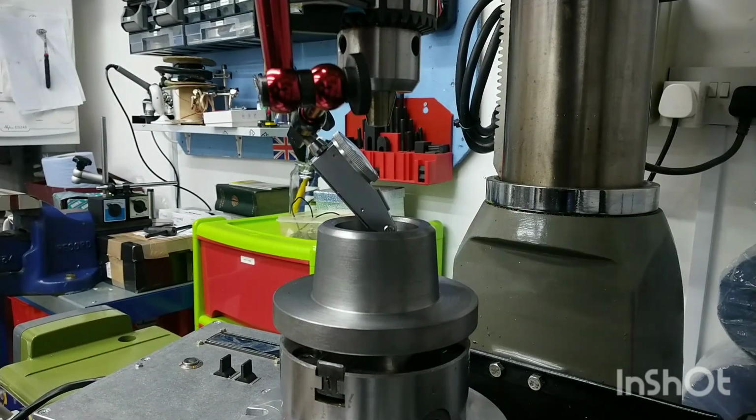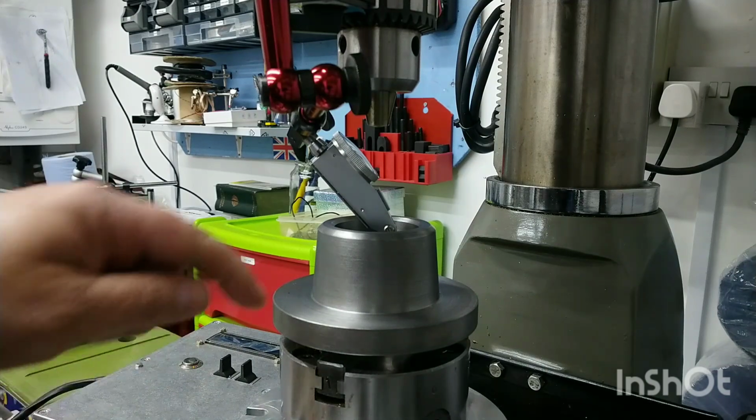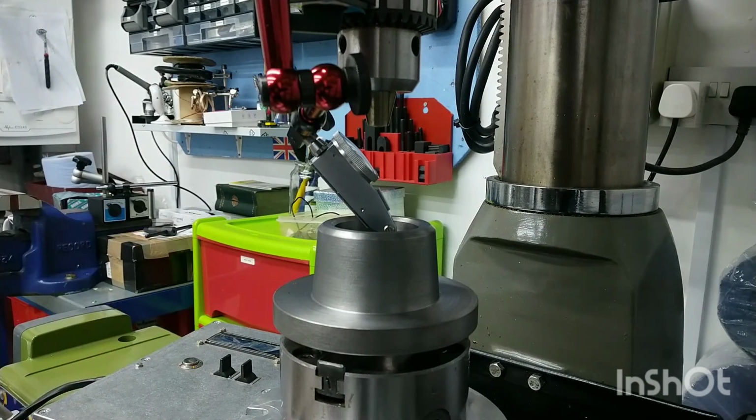So what we'll do next is we'll move the chuck over the requisite amount to get us onto our PCD. So the PCD was 3.625, if you'll remember. We went into that in some detail on the whiteboard. So 1.8125 is the radius that we'll have to move the machine spindle over. And now this is a metric machine, so that comes to 46.03 millimeters. That will give us 3.625, or within a couple of tenths anyway of that figure. So we'll do that now. We'll get a drill up and we'll start putting these holes in.